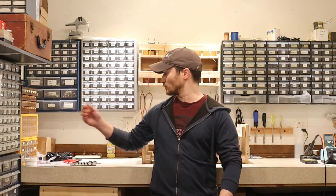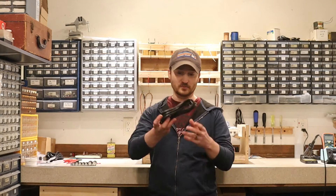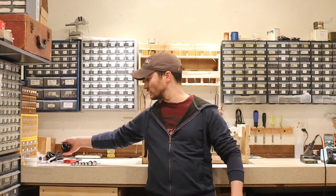Welcome back to the workshop. We're going to continue working on this AB165 Fender Bassman Amplifier that belongs to a friend of mine. I've got some parts in that I was waiting for, so now we can finish that power supply. I got the correct power cord this time — this is an 18 gauge. The other one had been 16 gauge so it wouldn't fit. So we can do that today and get started on some safety upgrades.